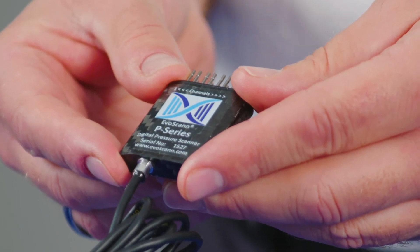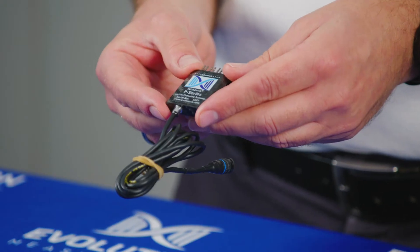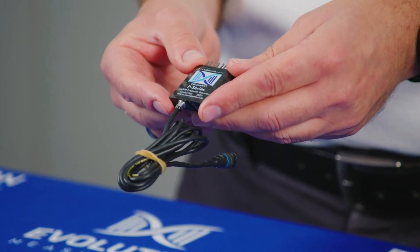Internally, we are running direct A-to-D converters and a multiplexer instrument to enable us to output over CAN bus directly compensated pressure measurements in engineering units, enabling pressure measurement to be read directly onto the CAN bus network of the test article.